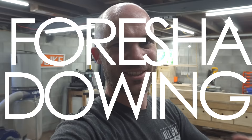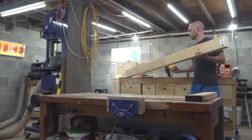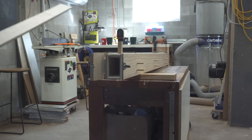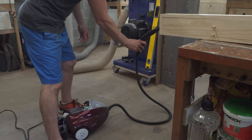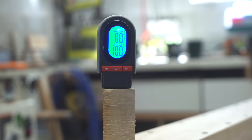The steam box is ready to go. I've changed where the steam enters the box to help it spread more evenly, and you want to tilt the box up so that steam rises through it while all the excess water runs back down through one of those holes. This is where having a thermometer helps so much, because you can see exactly when your box reaches the magic 100 degrees Celsius.